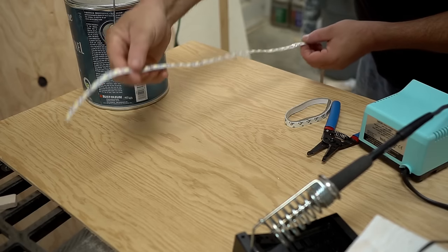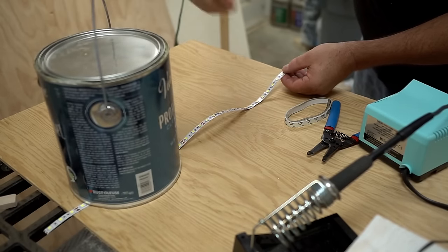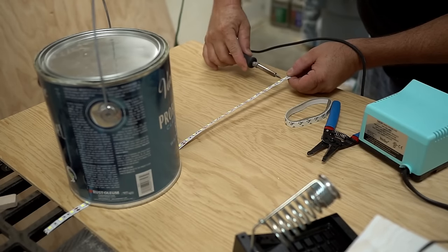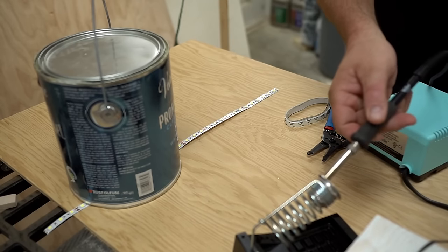First thing that I did was to find and buy what I hoped would be the right color LEDs. That's important if you want consistent white balance in your shots. And I wanted it to match the lighting that I already had in the shop. The one I bought was 5 meters long and it had 60 5050 LEDs per meter.